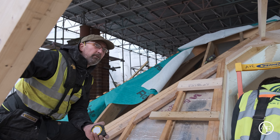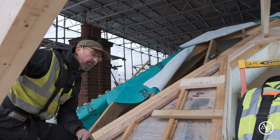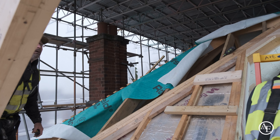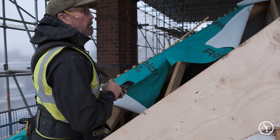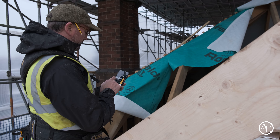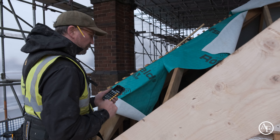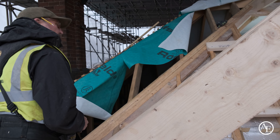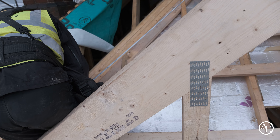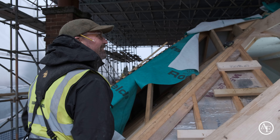I could actually knock in there 2525, but because I marked these at 600, so I'm just going to pinch that a little bit. There's two mil, makes me no difference on this roof. 2525 then. And then the last one then Pete, so it'll be 777. Plus 777 equals, that should be then 3 meters 302 mil. Let's check that. And it should be 3302. And it's 3302. Look at that Peter. On the money.